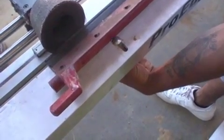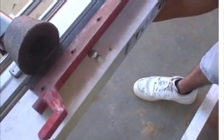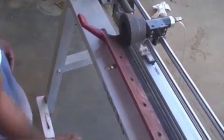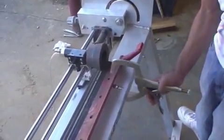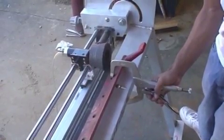Next, move the backstop to the back of the knife and secure by tightening the nut underneath. Repeat the same procedure on the other end of the bed knife. Using the special C-clamps, clamp the bed bar assembly to the grinder bed.